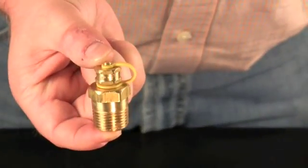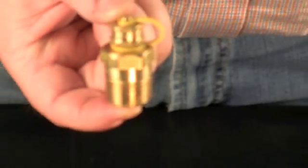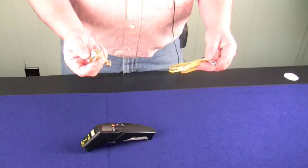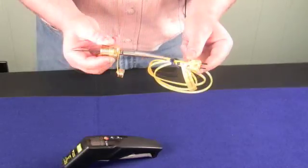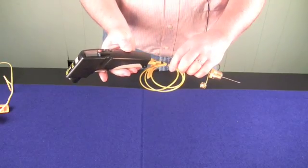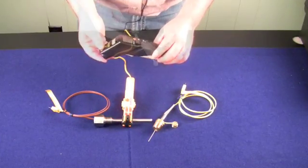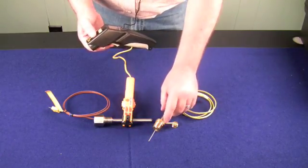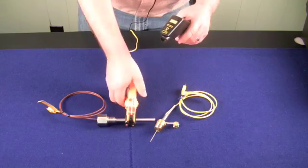Most of you know that this is a Pete's plug, which you will see out in the field on most startup applications. What would you do if you wanted to read your temperature? With the Stromquist accessory, insert your adapter — which also has a K thermocouple plug — into the Testo infrared, and you now have a digital temperature reading of the water through your Pete's plug. What makes this really cool is a K thermocouple for your surface temperature, and the versatility of digitally measuring your Pete's plug, your well adapter, as well as your clamp-on meter.